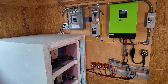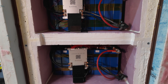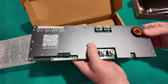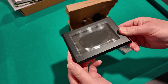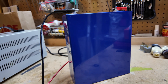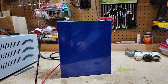For my battery rack, I will be combining the middle and the top batteries — they're both 8S — making a single 16S battery pack with a new BMS. This new BMS is an inverter style. It's been out for about a year and it communicates directly with the inverter. This is going to be a nice little upgrade — it also comes with a screen. This style is very similar to what you find in current server rack batteries and other large all-in-one battery solutions. I also purchased 8 new cells that are 280 amp hours each, and those will be combined for my bottom rack. So I'll have two banks of 16S cells.